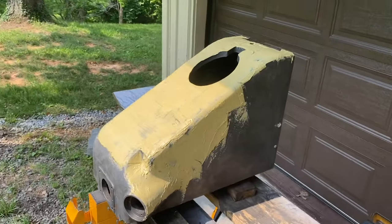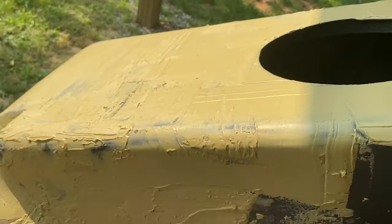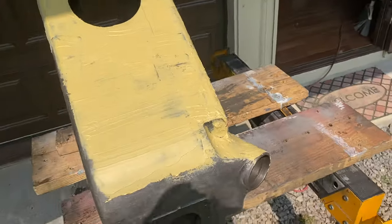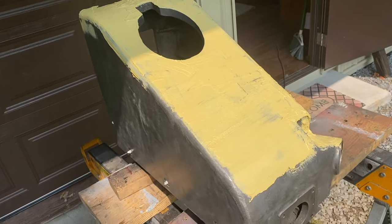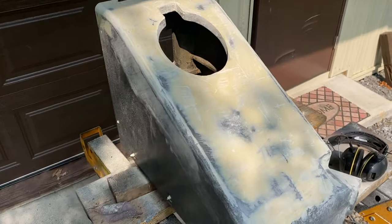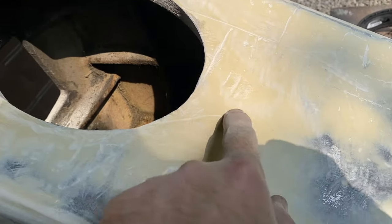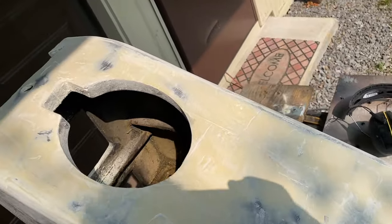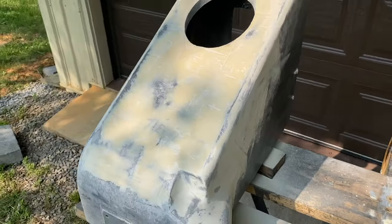That right there, ladies and gentlemen, is some fine, high quality bondo work. You know, this stuff, I think maybe I'm getting too much hardener in it and it just starts getting sticky, and I'm trying to slather it on thick because otherwise I've got holes. It feels like sticky peanut butter. Goodness. Here it is after some sanding. It feels nice and smooth except for all of that kind of stuff. So obviously I'll have to put some more on. What a tedious job.